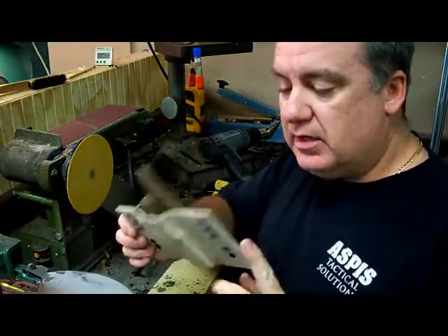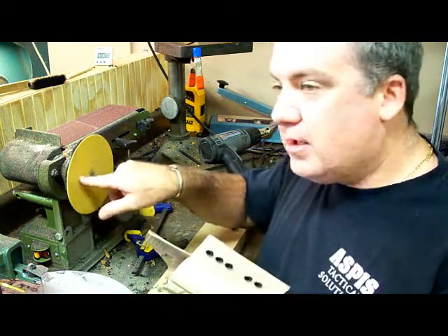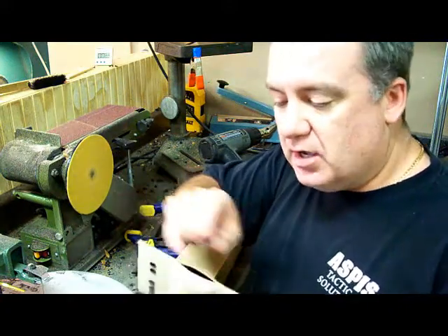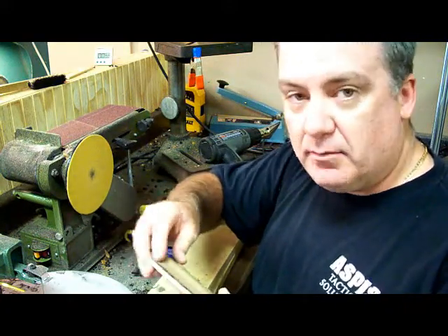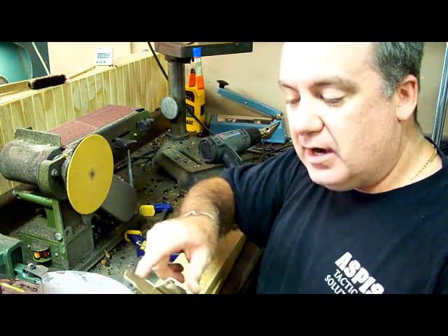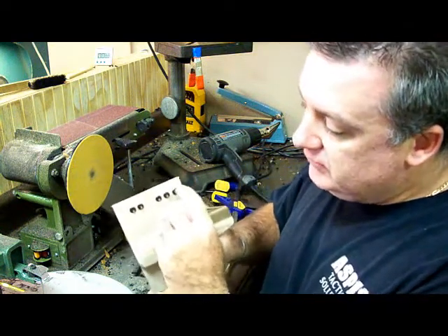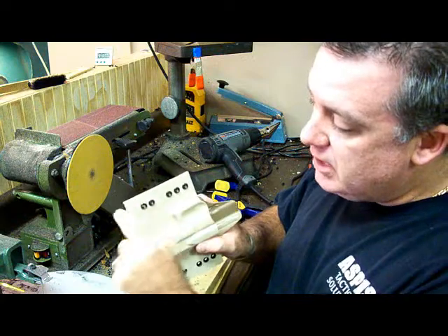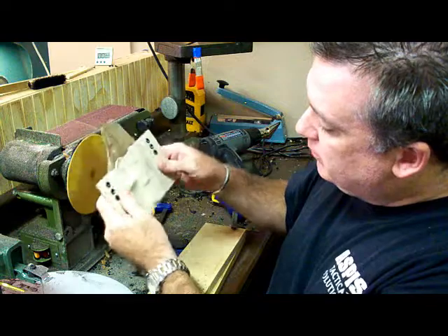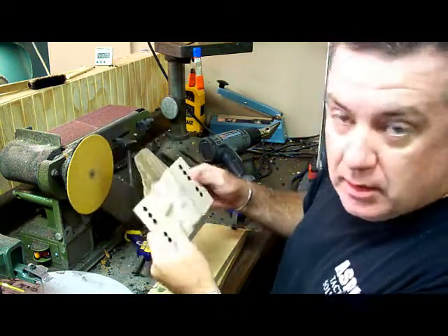Our holster is riveted together and I'm going to take it back to the belt and disc sander to true up these edges and make my curves — I don't want any sharp edges. I'm going to pay special attention not to touch the areas I've already pre-polished or pre-buffed. I want to shorten the distance between the rivets and the edges a little bit, true them up, square them up, and also make some relief cuts so this thing is not quite so boxy and wide.